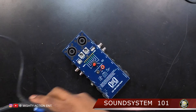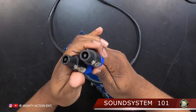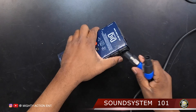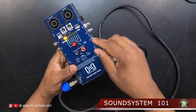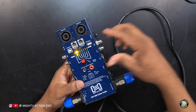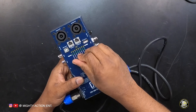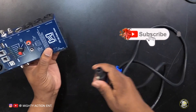Before the more complicated one, let me do a standard Speakon 4-pin. I only have two conductor wires in there, so only channels one and two are going to show. Channel one lights up instantly — channel one is good. Channel two — good. Since I only have a two-conductor wire in here, I can only check pins one and two.